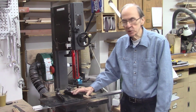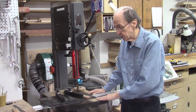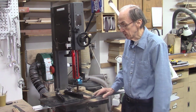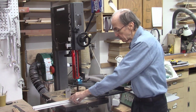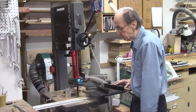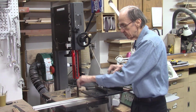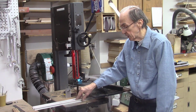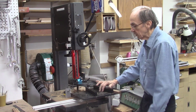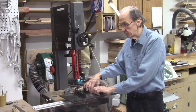So again, to answer the question, can the Accu-Wedge system be mounted directly on the bandsaw table without the Accu-Slice system? And the answer is yes. It can be done in two ways. It can be mounted in the miter bar slot with some special T-mount connectors, or you can drill and tap holes in your bandsaw table, and then screw it into that. So I'll be making this available in the future as a new product addition to the Accu-Wedge.